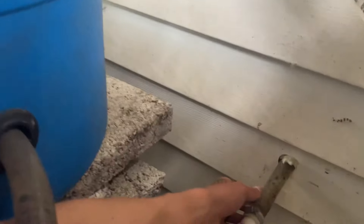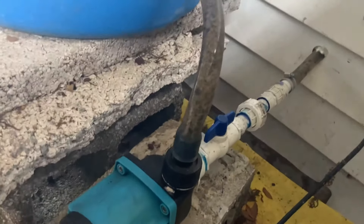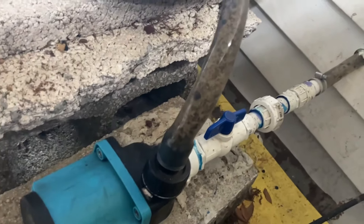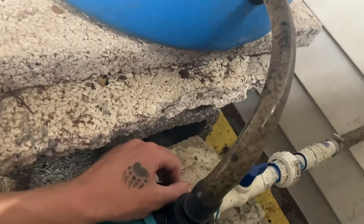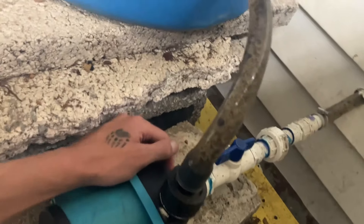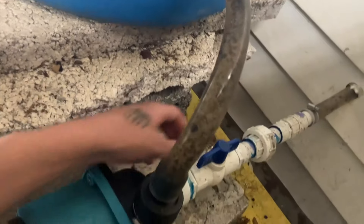Now that we've shown you the outside setup, here's the intake tube coming through the wall with insulation. You always want a valve on it because it can siphon out. When you start it back up, it'll siphon its own water so there's no air in it — that's how you prime it. You put water in to prime it and it siphons through, so you need to have the valve closed so you're not siphoning all the water out unintentionally.